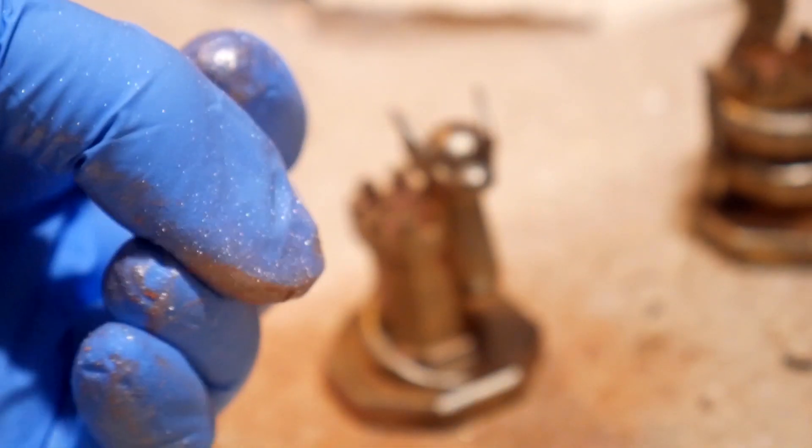A couple of safety considerations: gloves — you've got to wear gloves. These are very fine powders, worse than glitter, it gets everywhere. I got it all over my camera while filming this. You also want to wear a respirator, because these are very fine ultra-fine particles under 20 microns, so you can barely see them and chances are you're breathing them in if you're not wearing a respirator. Be safe, people — your health is not worth sacrificing for cosplay, prop making, or working in the shop. Health first.